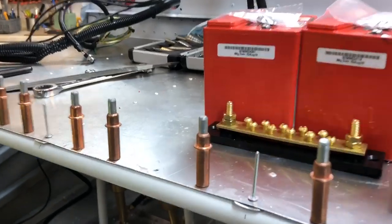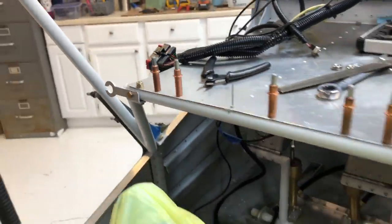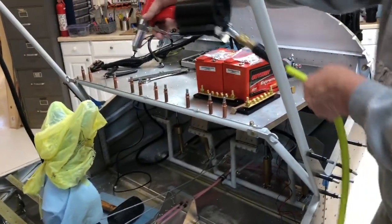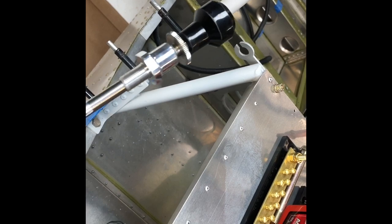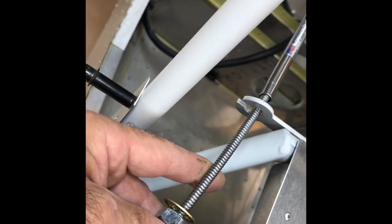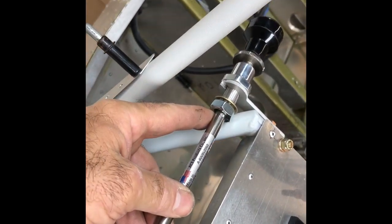While Alan is finishing riveting down the shelf, we've been installing the throttle brackets. Those are little pieces made up for Viking — just little angles like this. These you can actually use even if you've got one of those other little training engines; you don't have to have a Viking for them. One nice thing about these throttle brackets is you don't have to take the nut all the way off the throttle cable. You can install it after the fact — it just goes through the groove there and you pull it. Then you put the lock washer and the nut, through the firewall, and you're done.